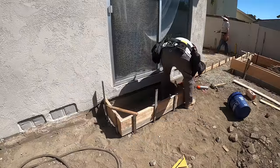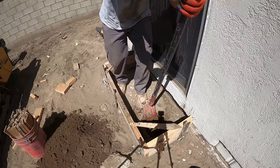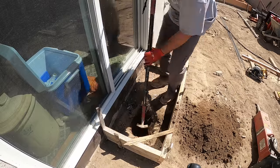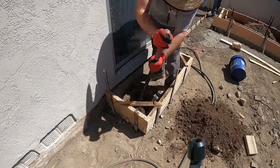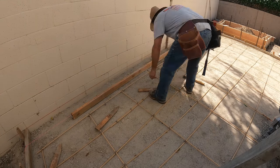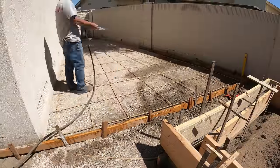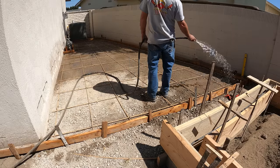Here's that porch — we're going to do all of them the same: just go 5 inches down from the existing floor of the house on each one so you have the same feel through each door. The ground was really soft because they put a layer of dirt in between the two concrete patios that was never compacted — they just threw it in and poured concrete. So I decided to dig post holes down at these little landings. You can call them earth teeth. I didn't want to drill into the house for supports because with a stem wall that's only 6 to 8 inches wide you really don't want to drill into those — so I just anchored it to the ground.